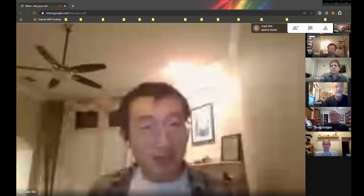So it's not just how fast you can communicate, but how often you need to and how much information you need to. If I put in a very high baud rate, but I don't transfer much data, it's not really wasting anything, right? It's just the interrupt doesn't trigger. Is that correct? It's only in the sense of trying to avoid the situation Chris was describing, where your interrupts are coming in so fast that the machine, I mean, 10 microseconds, even for these little machines, that's not very much. I, of course, would suggest that you use an STM32 ARM board where all that's done in hardware and it doesn't take any microprocessor time. That's just me.